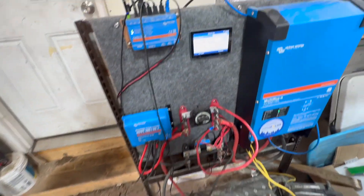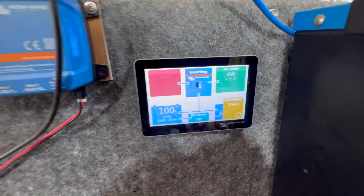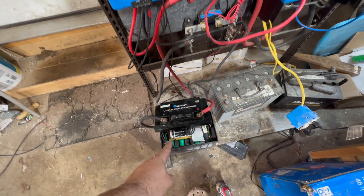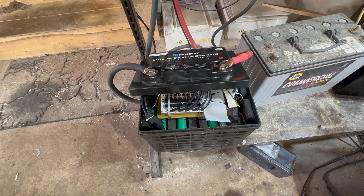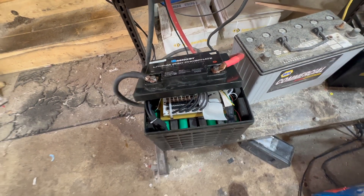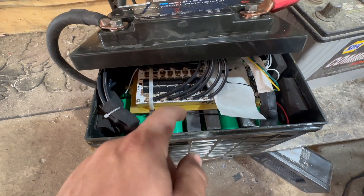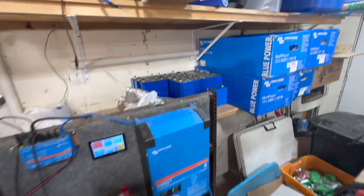So I started charging it properly on the test stand — throwing a little more amps at it now. We got 20 amps going into it. We'll continue to charge this until it hits 14.6 volts or so, then do a drawdown to see how much capacity is still in it. This is about a four year old battery. Worth pointing out — these Renogy ones use cylindrical cells, which is kind of interesting. They don't use the blue prismatic cells that most batteries use these days.